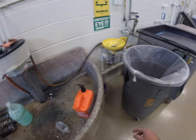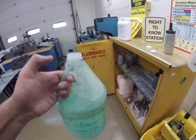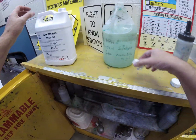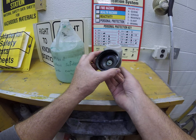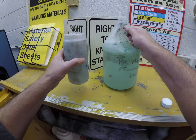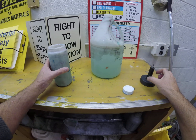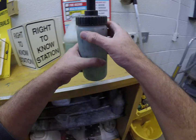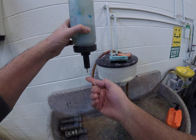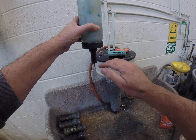That's good for the gallon. Remember there are four quarts in a gallon, so a gallon at the start of lab should fill up all the press bottles completely. Here's your quart bottle for the press — there's a little rubber gasket here, make sure you always have that rubber gasket, and there's a spring-loaded valve. We'll fill up your quart bottle. You can see the color has gotten lighter. Put your top back on, make sure you have your rubber gasket. When you turn this upside down the liquid creates a vacuum and nothing pours out; when you put it into the press the spring pushes up, breaks the vacuum, and you fill up your fountain tray or fountain pan.